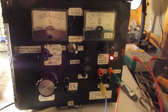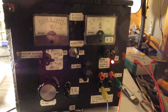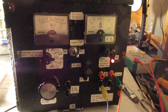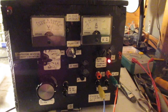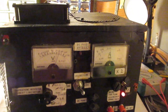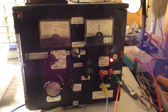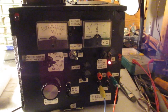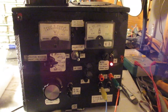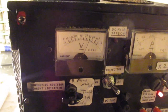That's, say, the solution that is more or less always used, say a positive of 30 volts and a negative of 30 volts and a zero in between, and in that case you have a 60 volts that's available to drive a loudspeaker, an audio amplifier or whatever. Very good idea, by the way, but in general I'm not very fond of these double power supplies, especially when there is no end capacitor to drive the loudspeaker. Anyway, a sea to drink, audio technology, etc, etc.